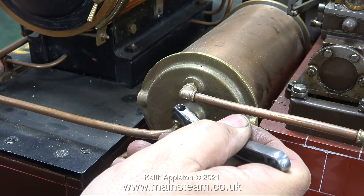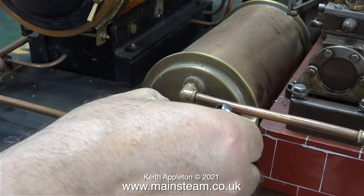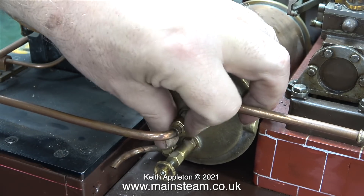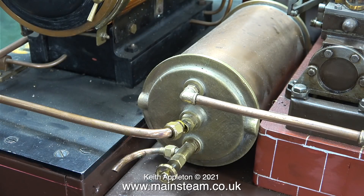When I first bought this steam plant, the steam went straight up the chimney complete with the steam oil, and it made a sound like a fish and chip shop frying tonight. Because it's not only steam that goes up the chimney - it's oil residue which comes out with the exhaust. That's why I built this large condenser oil trap to stop that. The exhaust steam is piped into this condenser oil trap and the oil remains in the tank. Periodically you do have to drain this tank into a suitable receptacle for disposal. It's a very simple device - a piece of copper tube and these two really nice gunmetal end caps. You can get these from Black Gates Engineering.